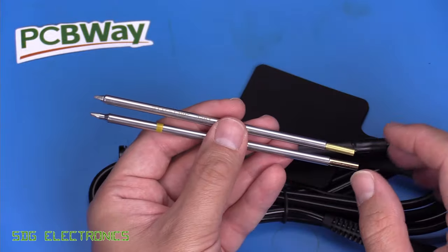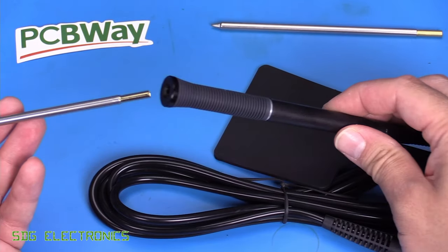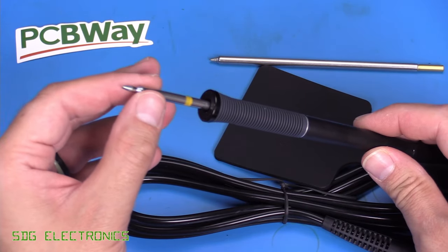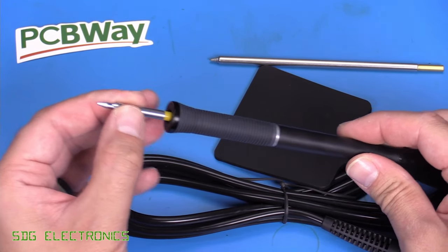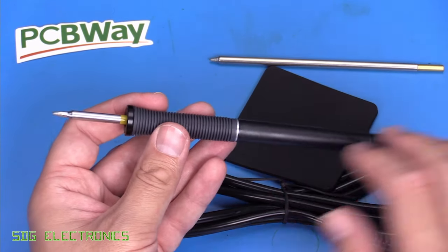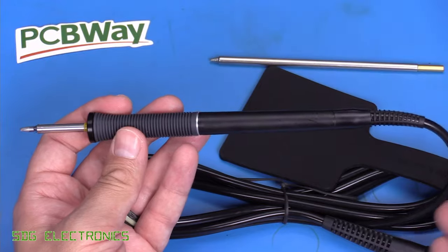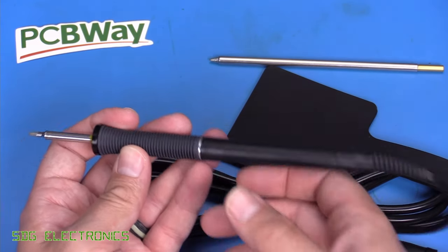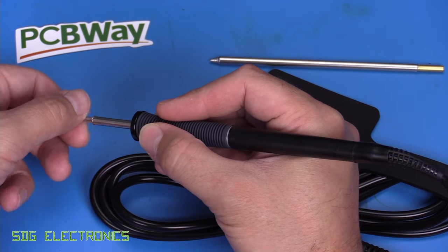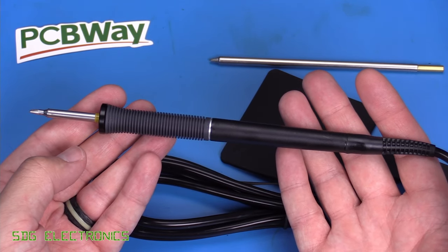I don't think I've heard complaints about Thermaltronics cartridges failing early. Let's see how they fit in the handpiece — they slide freely up until about this point, then you push it home and it grips nicely. You can also rotate the cartridge, because some soldering stations have a keyed cartridge, meaning after the natural droop of the wire you end up holding the iron at a fixed angle which can be quite annoying if it's off. So that's all fine and works as expected.